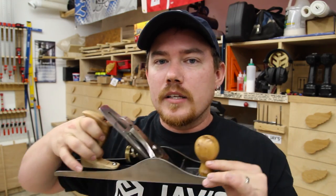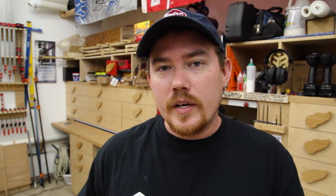Luckily I didn't take it out of square or out of flat at all. I tested it by setting it on the table saw wing and trying to rock it left or right to see if there was any twist — there really wasn't. I just tried to polish it a little bit with some sandpaper, only went to 120 grit on the bottom. I put some three-in-one oil on it to soak into the pores or small pitting areas, which does a lot for preventing rust in the long term.